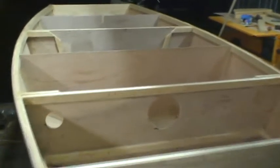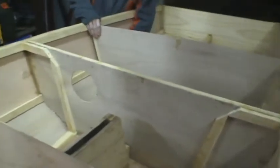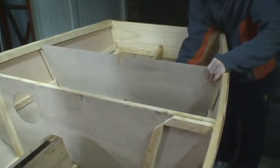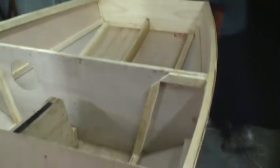Here it is back inside. Now all we need to do is remove these temporary stations from the inside of the boat. This is station number two coming out — because the bow widens, it's pretty easy to just push this one aft and it should pop out. Now number three — released around there, all we need to do is just flex this one a bit, turn it, and out she'll come.